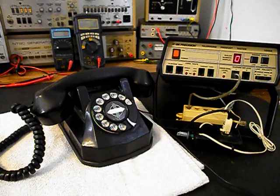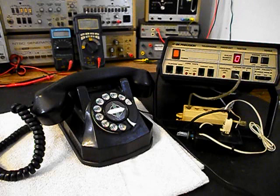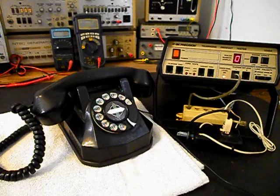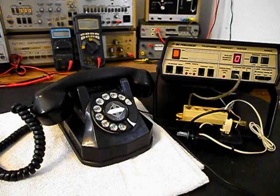Now what we want to do is go ahead and use the analyzer and send a ring cycle like you were getting a call. So we'll start that. We'll let that go a few times. I'll let it go one more time and we'll give you some dial tone.